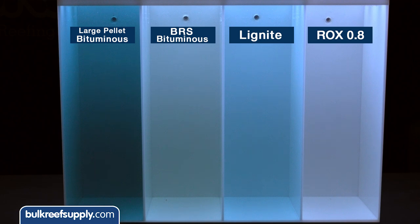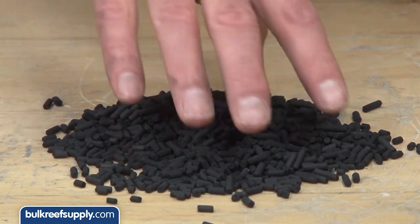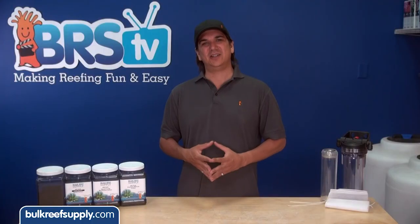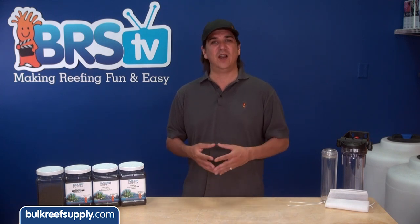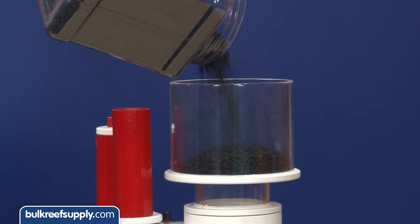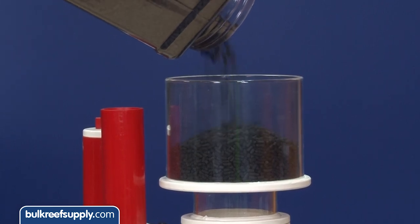That last chamber contains a large pelletized bituminous carbon which you can see performs pretty poorly in this demonstration. These large pellets are pretty common in retail products within our industry — they look nice and uniform so if you didn't know any better you might assume they are better. In reality these large pellets are designed for air and gas filtration and perform very poorly in water due to available surface area, channeling effects and small pore structure. The only time I tend to use a carbon like this might be for filtering odors from air or ozone.